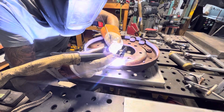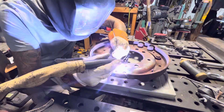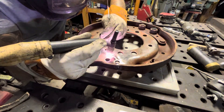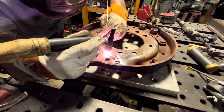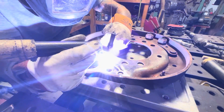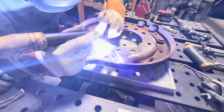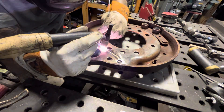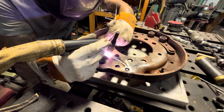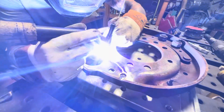I'm using my pulse right now — sometimes I use it, sometimes I don't. Feeding my filler rod. Anytime you're welding with stainless, you want to form your puddle — one to two seconds — you want it to form quickly. Get your heat in there real quick. Most people are afraid of overheating stainless, which you definitely don't want to do, but the common mistake is people will not run enough heat and travel super slow, and that ends up putting more heat input in the end. You're better off getting in there hot and moving as quick as you can.